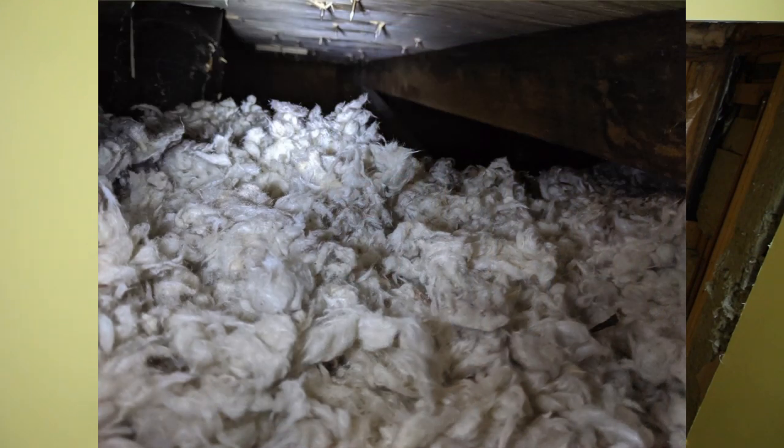The old fan was nailed in — there were flanges nailed to the joist with no way to access that from below, so I had to go crawling in the attic. I had to go digging through six inches of cellulose to find the fan, get it disconnected, and so on. That's when I discovered that the old fan only has a three-inch exhaust hose on it, and the new fan wants a four-inch exhaust hose. I just can't win.